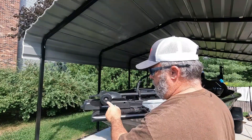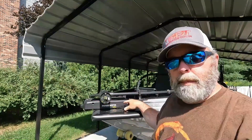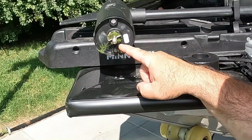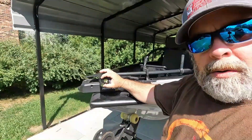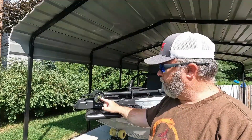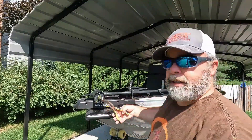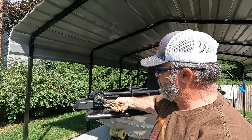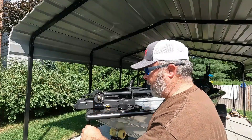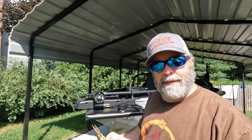This is the T-nut, and there is a washer there. You pop it off — here's your prop — and there is your problem. I knew I had some grass on there because I could feel it. Sometimes you'll have a whole ton of it, or even a whole bunch of fishing line. Last week I swear I had a hundred yards of fishing line on here. You also have this drive pin, which goes through the spindle. Sometimes this stuff can be tough to get off because it's wound on so tight, so I usually use pliers. Sometimes I need to use a razor knife on strong weeds or fishing line to get it off.